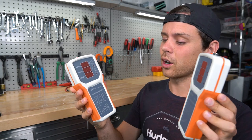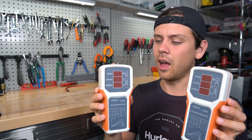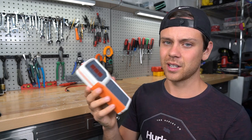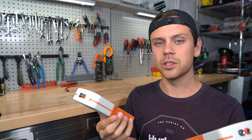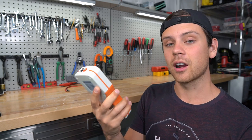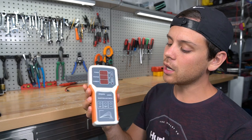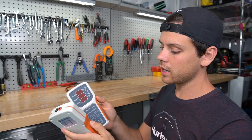I'm pretty bummed that these meters do not work — 2% is not acceptable. If I saw a 0.1% difference I would accept that, but absolutely not. I cannot use that for test equipment, especially over a Victron. I might keep the most accurate one to test used panels, but I could just use my multimeter anyway. It's nice and lightweight compared to carrying a battery and a Victron solar charge controller, but I feel pretty let down. I thought this was going to work really well — it's such a simple device, why can't it be more accurate? And that's pretty much it for this video. I'm a bit sunburned — it was 113 degrees today. I'll talk to you guys soon, thank you so much for watching.